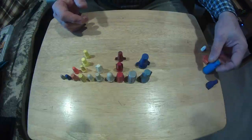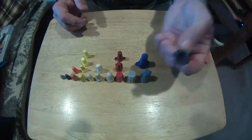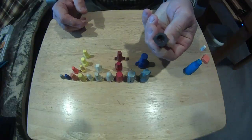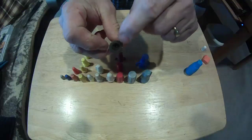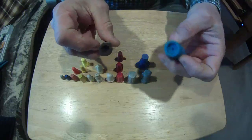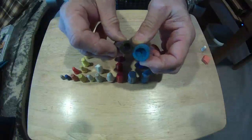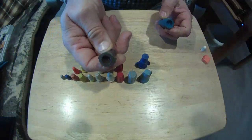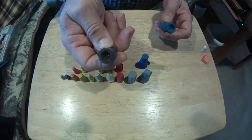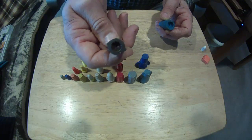Now when we talk about specialty wire nuts here, this is a purple one. And you notice that it's dirty because I've had this in storage, but it's got little fins at the bottom. This is a blue one. See the little fins? Both of these are filled with a jelly. This one's filled with a deox or a penetrox. It's a corrosion inhibitor jelly.